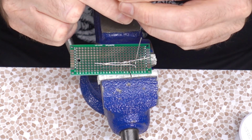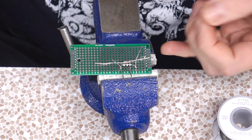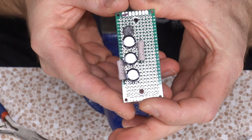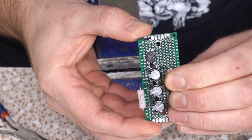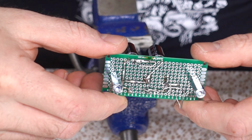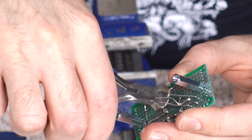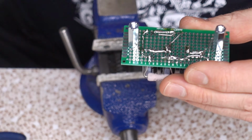If you're talented at doing this kind of thing accurately, you can create some art. I just wish I had a snip small enough. Oh, we're flying along there. I got the first 3 sections done already. Again, if I think a resistor's gonna generate heat, I float it. Also gives me room to work underneath here. Oh, she's tight, but she should be good. Yeah, something like that. So we have some leads intentionally left long. Not this one though. These guys will wrap up against the AC input at some point.